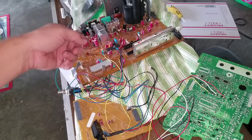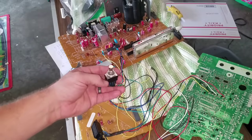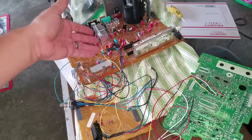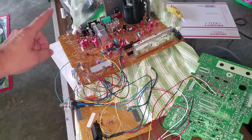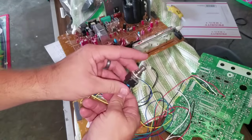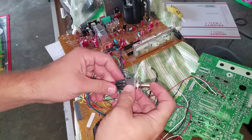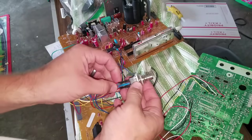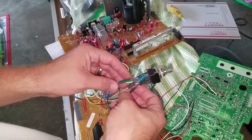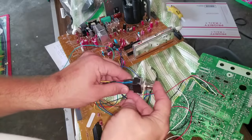The signal is going into that and being fed through this switch. If we switch it on, our RGB signal will go into that chip, hopefully with the blanking line. If we push it again, it gives it back to its normal OSD. This is a DPDT switch — specifically an on-on switch. The middle goes to our chip input, the common. On one side I have the RGB and on the other side I have the OSD soldered in, and then you'll be able to switch back and forth between the two.